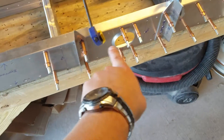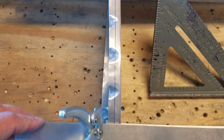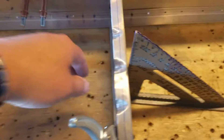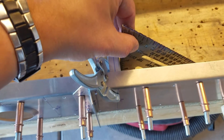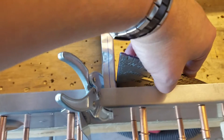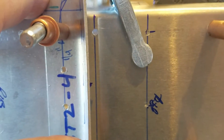Now the front spar here has the front mounting brackets. One thing I wanted to point out about lining up - you can see here the rib is twisted, and that's something you have to correct when you do this. What I initially did was line up the sight line in the hole, clamped it into place, got my square out and untwisted the rib up against the square. Lining up the rib so that it was square - there's a little buckle to it too - push it tight against there, make sure that it's square, then recheck your sight lines. You see how that has moved, and that's just because the rib was twisted. Now that I've got the rib square, I need to readjust these sight lines a little bit.